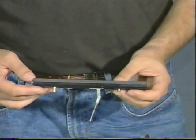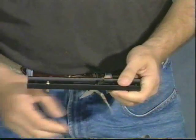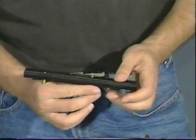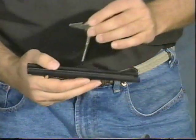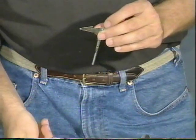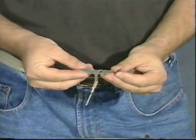And we have left the sear assembly. In order to take the sear out, it comes out through the top of the rail. You push up from underneath, slide the sear forward and it will come out through a hole. The sear pin will slide out from the rail, and there you have your sear.